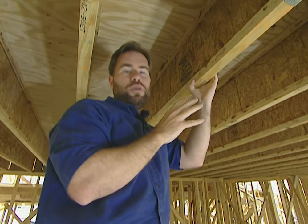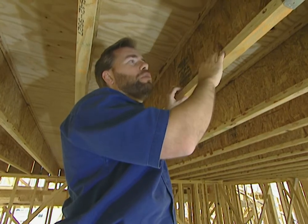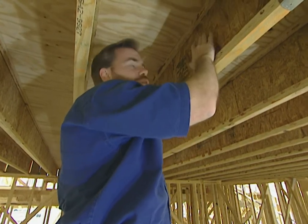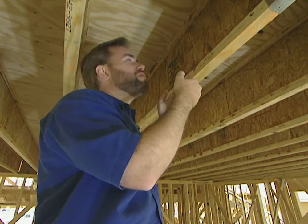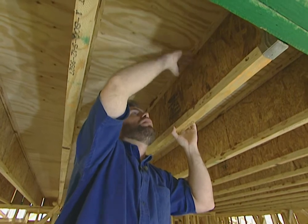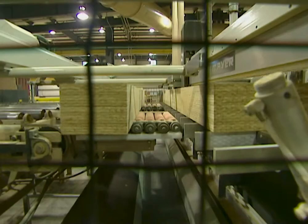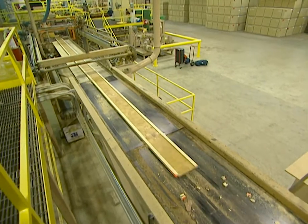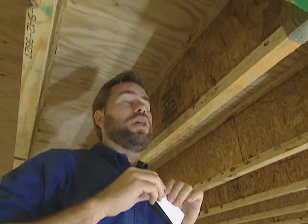The reason you use an I-joist like this is because this engineered wood will not warp back and forth. If you had a 2x12 like homes used to be built with, that solid piece of wood is hard to keep straight — it can warp up or down a little bit. Then your decking is not going to be flat, level, and smooth because the base isn't flat and level. With engineered wood, you get a flat surface, and if you get your decking perfectly flat and attach it right, it's not going to squeak.